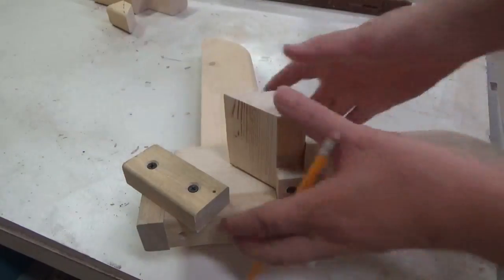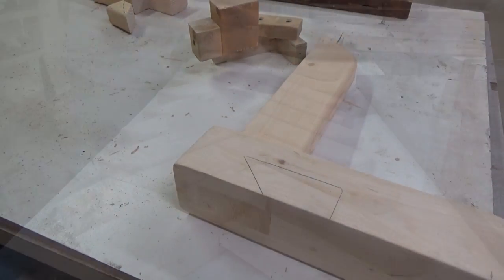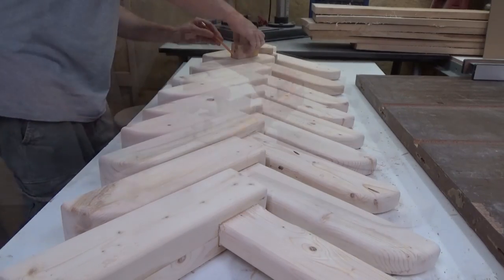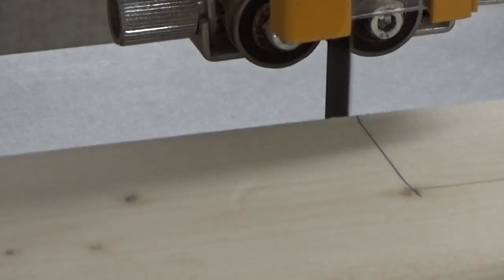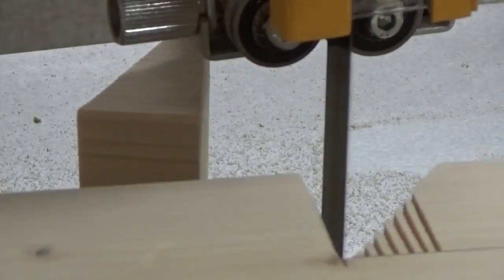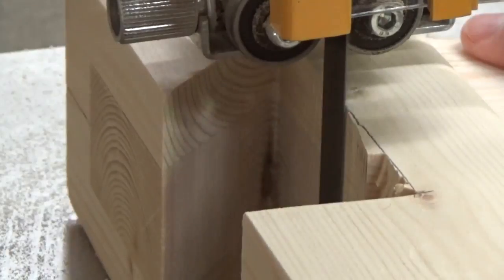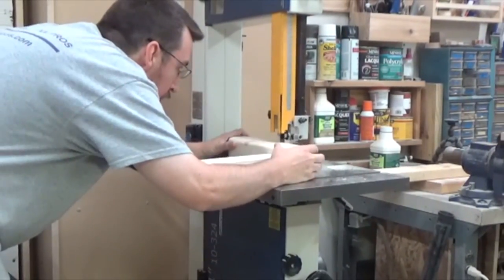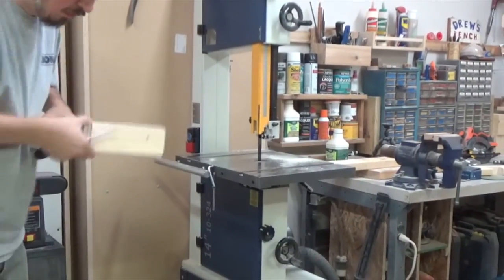I made a jig to act as a stencil showing me where to make all my cuts on each of the brackets. I could have just measured for each one, but this guarantees that each one will be exactly the same — plus it's funny looking and it was fun to put together. The last step in making these brackets is to make the cutouts on the bandsaw. To get my blade in there, I had to make a handful of cuts and break them out with a screwdriver, then get my blade in there perpendicular and finish things out. Each bracket also got a notch cut out on the bottom so that it can sit flush against the wall supported by the cleat just underneath.